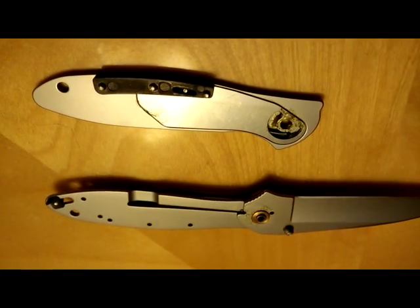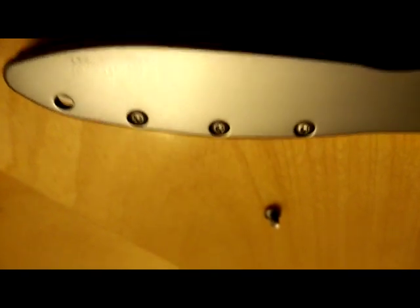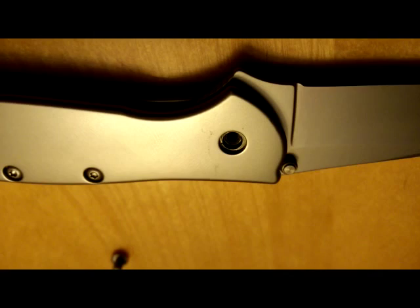Make sure you go ahead and apply some grease here as well, and take the two halves and put them together carefully. Go ahead and after you put them together, the two halves, go ahead and tighten down the three bolts here. After tightening down the three smaller screws, take the larger screw and go ahead and put it here. Tighten that one as well.